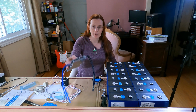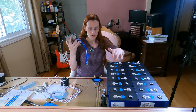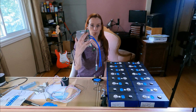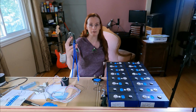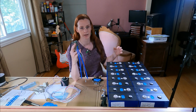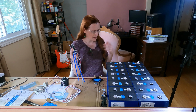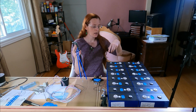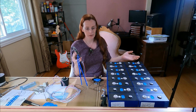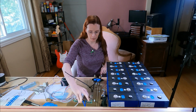So the job of the BMS is to make sure that it can monitor each individual cell voltage and it can monitor the temperature. So I've got them nicely tied up here, but I've got 3 temperature probes that I can put around the battery. If any of them show 0 degrees Celsius, or I believe I can set it a little bit higher, like 2 degrees Celsius, it cuts off the charging. What a lot of people will do, and I'll probably do as well, is wrap them in silicone heating mats and run that off of a standard lead acid battery so you can warm the pack up. If you're somewhere where it gets below freezing, then you can safely start to charge the batteries back up.